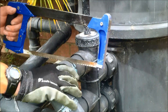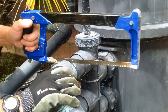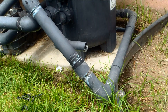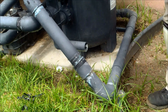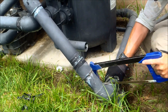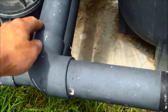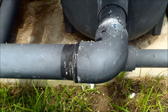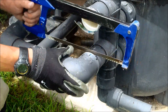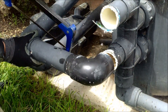I'm going to make my first cut right here, cut this elbow off. I cut that all the way through and I'm going to cut down here. I got that cut off and I'm going to cut right down here in this bottom elbow — it's also leaking down here. It's also leaking right here in this pipe so I'm going to take it off from the elbow here and re-plumb that whole section. I'm going to cut right here also and cut this part of the elbow off now too.